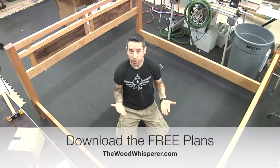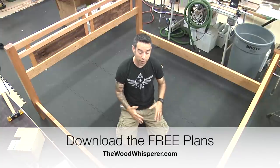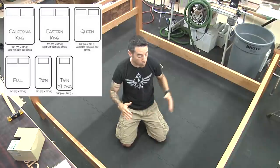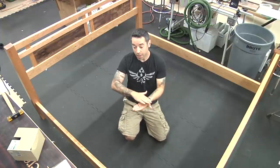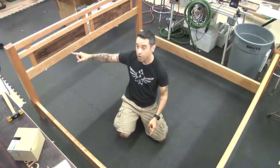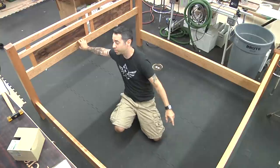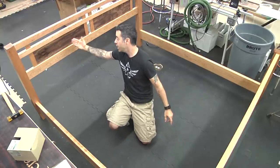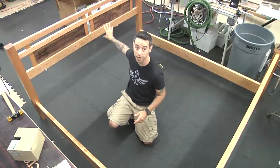Of course, we have plans available in both SketchUp and PDF, and the dimensions we provide are for a king-size bed to fit this internal space. If you have something different, the good thing is mattresses are standard sizes, so look up the size and subtract accordingly to bring the dimensions in to suit your needs. Keep in mind, though, thickness could be an issue. Mattresses are different thicknesses, and the amount of bedding you use could make it a little bit taller, so you may want to adjust the height of your legs to make sure this rail is located in the right place. You don't want your pillows and the bed itself sliding under the rail, and you don't want it too high because it could get in the way of your design here.